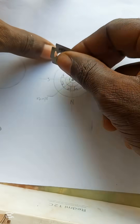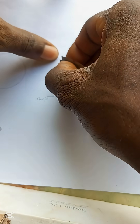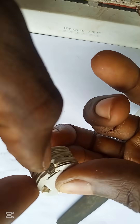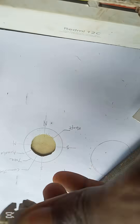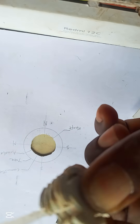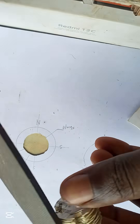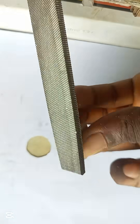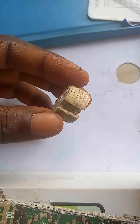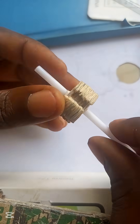Now it's time to bring our design into life. We start by cutting out the armature pattern and recreate it as many times as needed. For simplicity, we will use a thick piece of paper in place of laminated steel plates. After cutting, join the pieces together to form a single armature. Remove rough edges and excesses with a file, then make a hole in the center through which the shaft will go in.